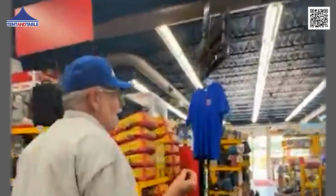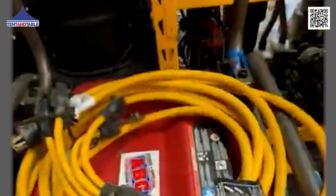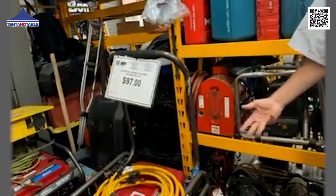One of the biggest things that I see is people do not take the time and invest in their NEMA twist lock storm cords like this here. There's a couple reasons that storm cord is important to use, because generators run better when they're maxed out. You're exercising the entire motor or armature. If you're consistently just running off of the 2 duplex receptacles, you're only getting half the power out of it. And you're actually going to treat the generator alternator better if you were running 1 blower, 2 blower, 3 blower, and 4 blower.